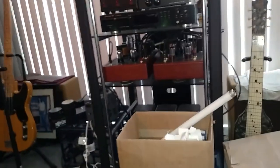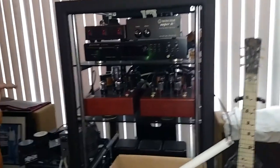So home audio? Yeah, like those two top units are single-ended like that. But what happens is that you can use very high-efficiency speakers to make that small wattage very powerful. And you can't do that in a guitar amp. The speaker would be too big to carry. It would have a giant horn in it and huge drivers. That's how you make speakers efficient enough to make 4 watts sound like 50 watts. So that was out in the guitar industry.